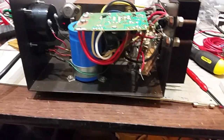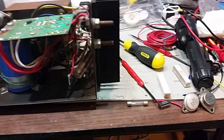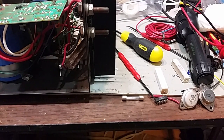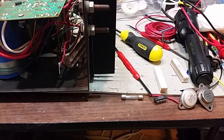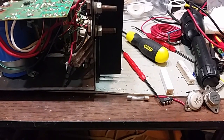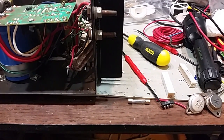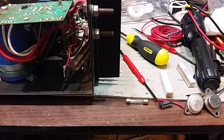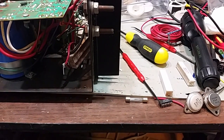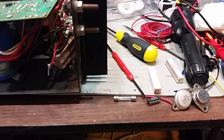This supply is supposed to have a 5-amp line fuse, and I pulled it out — it's a 7.5-amp fuse. At some point, whether it was because they had a couple fuses burn up or they were tired of swapping them, I believe this was used as a repeater site supply in an uncontrolled environment out in a cabinet. Somebody either used what they had on hand, or got tired of going up the mountain and put in a bigger fuse.